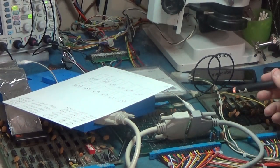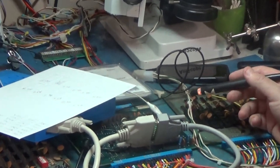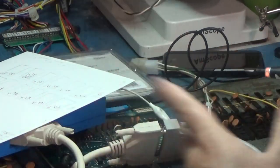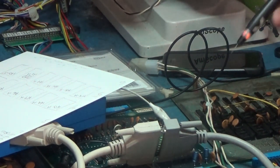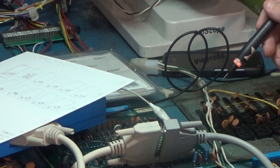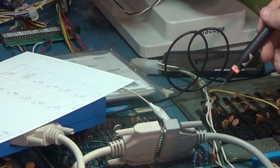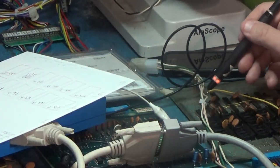All right. Well, I'm starting to see some kind of funny business over here. I'm just hitting addresses, and I'm looking at the schematic, and the schematic tells me that these 42s that select all of these ROMs get inputs from the address bus. Right now I'm reading from 0000, which I know isn't a ROM thing, but I just want to look at those upper address bits. And they should be all low.